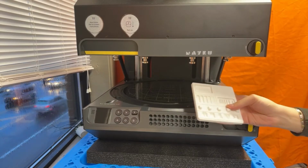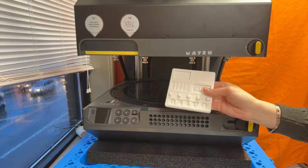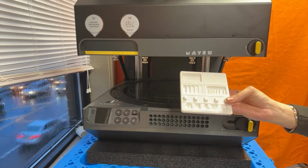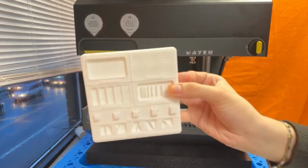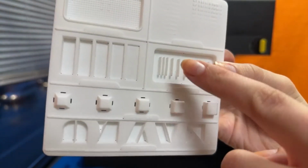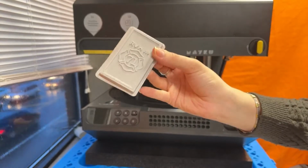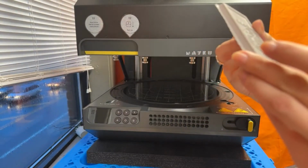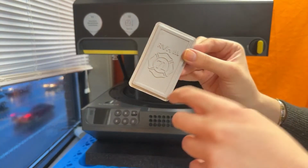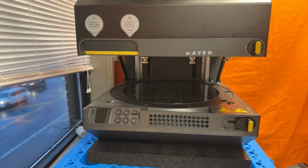Do I have holes in the things that I'm using as bucks? So, this is an SLS print. Apparently, it has enough holes in it that they said it's fine. Also, it does look like they put a lot of little holes in the corners and stuff, which is good design. This one is a polycarb print that I did. I've done a lot of vacuum forming with it. It seems like FDM printing is porous enough that that's fine. I also, not on this one, but on the ones I was actually using, attempted to put holes in the corner because it just made the shape a little better, but it should be fine.